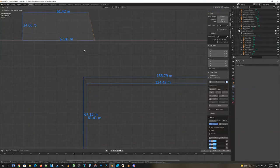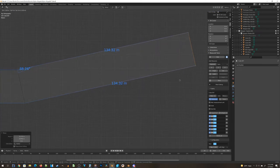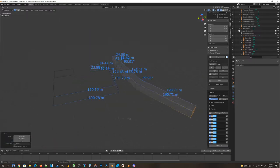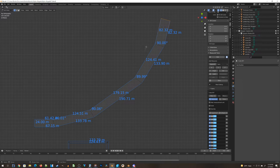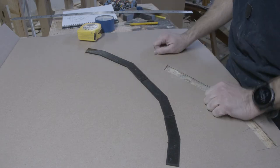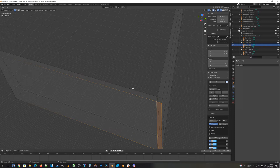With designing these robots, I probably have a bit of an infamous reputation in that I use Blender for most of my design work. While this artistic 3D modeling program can work pretty well, it's not the ideal tool — it's not CAD. When it came to designing the armor band and converting it from a 3D model to 2D templates, I did run into some limitations. My first attempt required very specific distances as well as very specific angles, neither of which Blender is very good at. When I printed this set of templates out and lined them up, I noticed that the armor band got thicker as things went along, so something definitely went sideways.